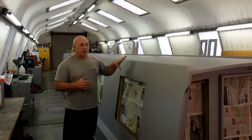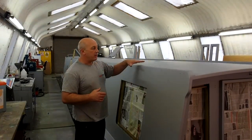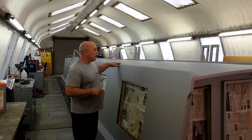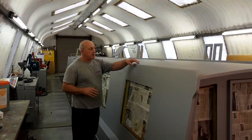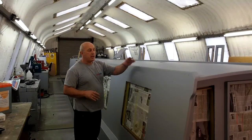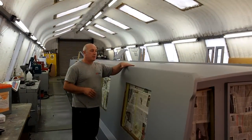So that side of the job is sorted out quite neatly. These big large areas we're just going to roll straight on, get a decent finish, and as I said we're going to rub them down later. The handrails — we'll actually keep a brush with us while we're going, and as we're painting the top of the handrails we'll just lay it off with the brush, leaving ourselves a smooth finish. Because when we go along with the sander at a later date, you don't want to be trying to sand small narrow areas — you'll just cut through the paint and end up with bare bits. These can be done by hand. Machine the large areas, rub down the small by hand.